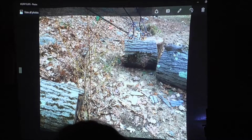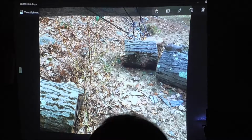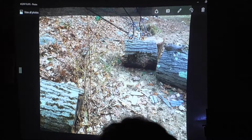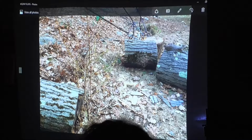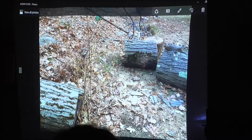That's very true also. And of course, it's not okay when the wind comes in the direction of your guys holding in place, because there are twisting forces. And if the wind's coming in between, it still creates other forces. So no matter how you have your guys set up, you want them as tight as reasonably possible, but not over tight, so that you don't allow the twisting forces any more than they simply have to be there. So that maintenance is important.